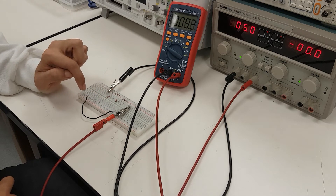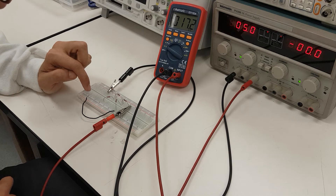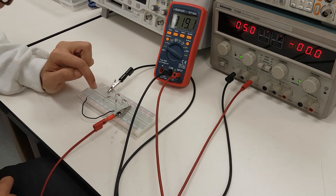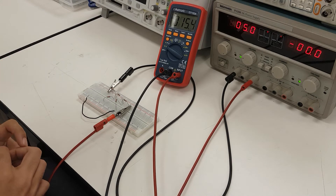Note that in the first scenario, we are not connecting the two 2.2-kiloohm resistors. The way we are going to validate Kirchhoff's laws from this circuit is by measuring the voltage difference across individual loads in this more complex load, according to the orientation as provided in the lab manual.